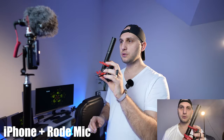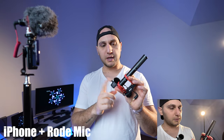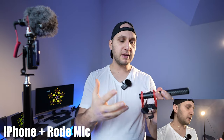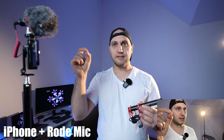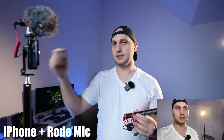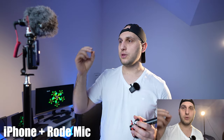Check how small the microphone is without the windscreen. The second very important thing is the sensitivity of the microphone. This expensive microphone has an amplifier and you can adjust the audio levels, producing very nice and clean sound. The cheaper one doesn't have an amplifier and draws electricity from the phone — but actually that's the better scenario. Because when you plug a very sensitive microphone into the iPhone, it clips like crazy. You cannot adjust audio levels in the default camera application, so for iPhone you have to use a microphone that is not overly sensitive. Links to good shotgun mics for the iPhone are in the description.